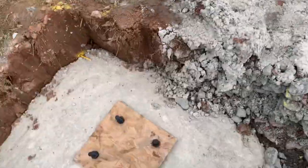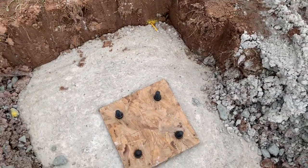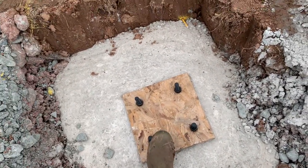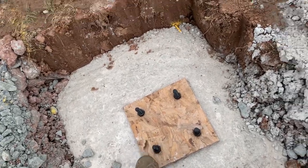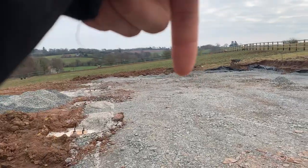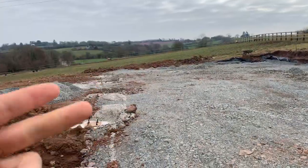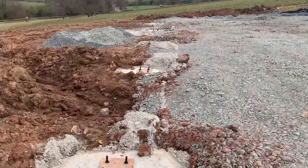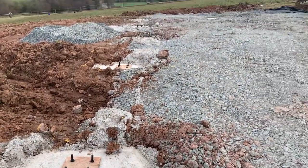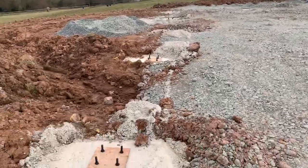We've got roughly meter cubes in with these bolts concreted in. We've got six on either side, and then we opted for having a gable post because if we're building a wall we want something to build up to, rather than having to put in some supports for it. We're not going to be entering through that way anyway, so that's good.